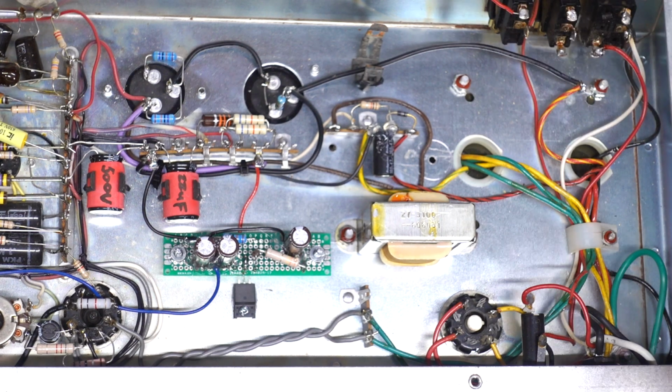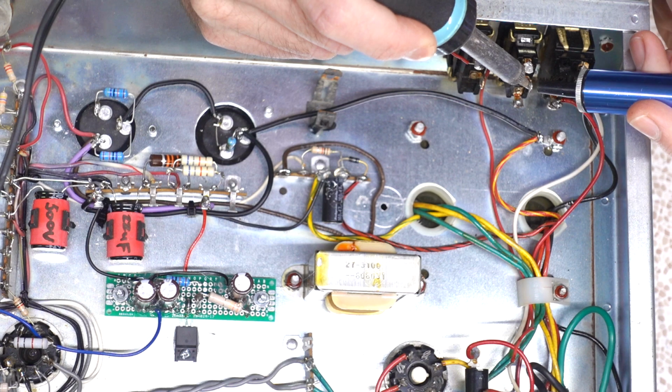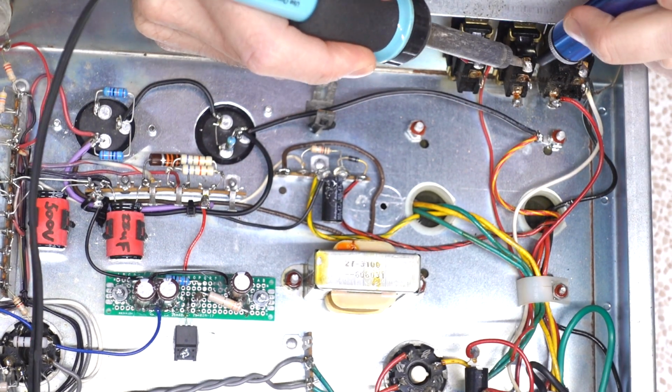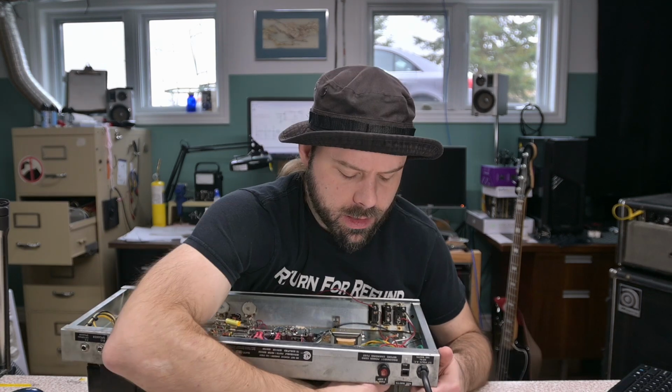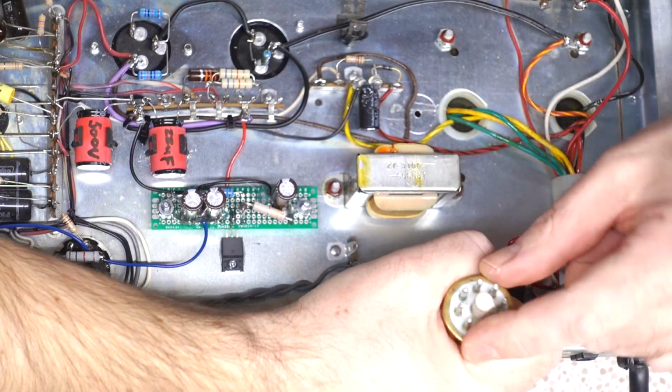And in actuality, I might be making a stopover at this switch here, because I'm thinking what I would like to do is make this a dual rectifier. We can maybe experience the difference between a tube and a solid state rectifier. Now, I do believe this guy has all its pins. I don't know what the pinout is on this guy.